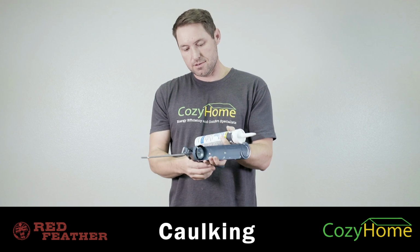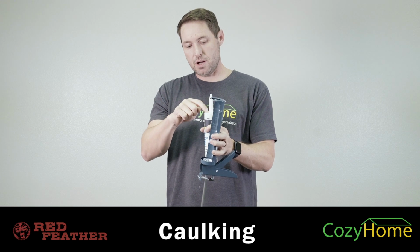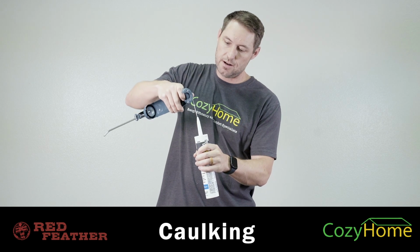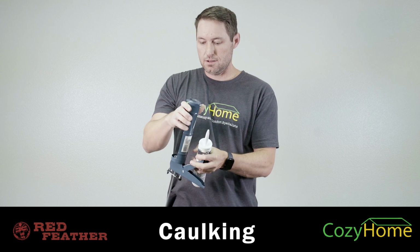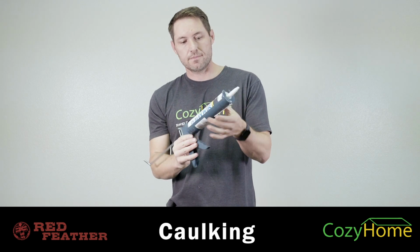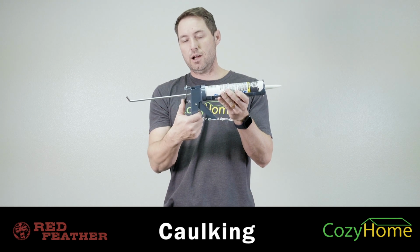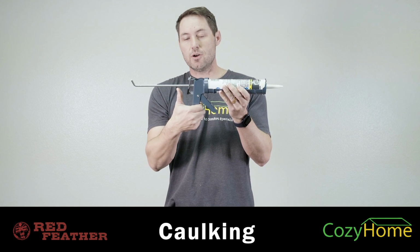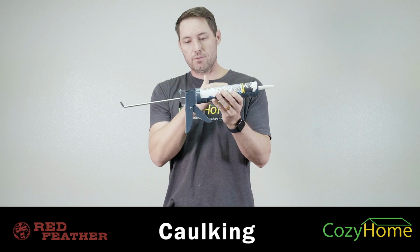And then once you do that, there's a little membrane inside the spout here that needs to be punctured, and that's what this little thing is for. What you do is you just slide it down into the caulking tube and then load it into your gun and squeeze it. This caulking gun actually has an auto release on it, so when you let go of the trigger, it pops back and stops the caulking from coming out. But some caulking guns don't have that, and you actually need to push this button on the back every time after you release to keep it from coming out again.